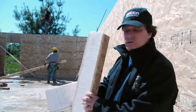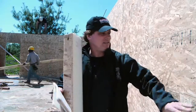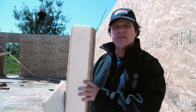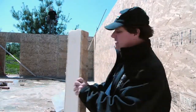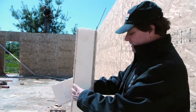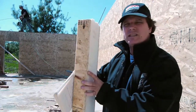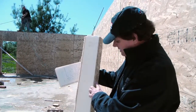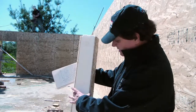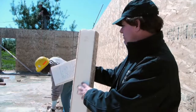I just wanted to show you this — it's called a spline. It's what goes in between these panels to make the building airtight. Everything gets spray foam. What happens is the panels are sandwiched together and held together with the spline. So we can see the two layers of aspenite — 7/16th aspenite — and the star foam giving you your R-value: R30.